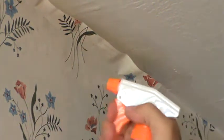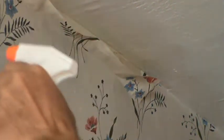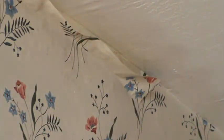I'm going to put a little bit more water on here and let it set some more. Because once the paper starts tearing, you can still remove it — just spray some more water on there and get it saturated. I'm going to spray a little bit on the back side here now. While I'm letting that set, I'm going to spray some more on the preceding area so that it can just be working itself in. Once I work on this one, the next one's going to be ready to go. Just always have a little plan going and work ahead of yourself.